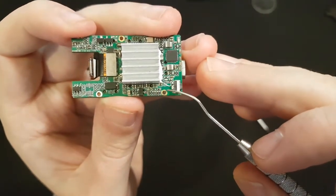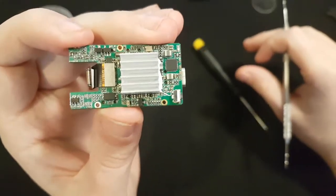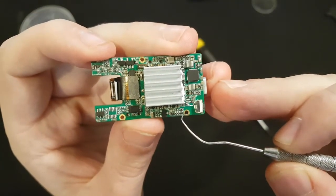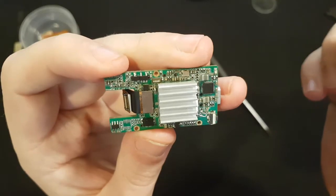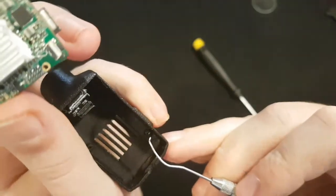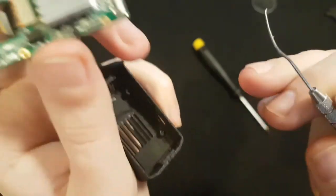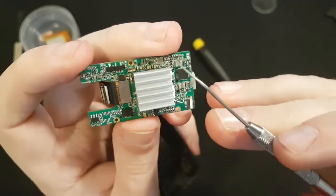In the process of designing the case and test fitting it with cases that weren't quite perfect, I did actually manage to knock one of these resistors off, and it was a pretty fiddly job to solder that back on. Luckily I managed to and it still works fine. But do keep in mind when you are installing the case that one of these components is going to sit on top of one of these screw bosses. So when you're putting it in, you don't want to be sliding the board back and forward across the top of the screw boss too much — you want to be fairly careful with that.